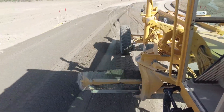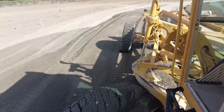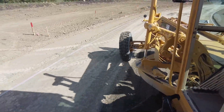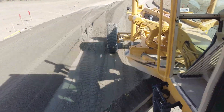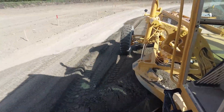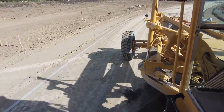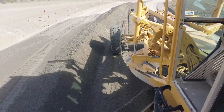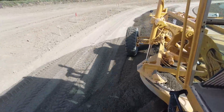There's a little less gravel on this job — the structure is a little less. Here I am putting it over to the edge now. Sometimes if the trucks come in all at once I'll let them all dump down the middle, and then when they leave I'll have time to put it over to the edge. It works out pretty good doing it that way — you just keep stripping it down and putting it over to the edge.